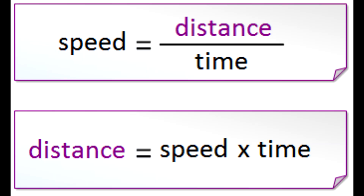Through this process, the sensor is able to find out the exact distance between the sensor and the solid object that the sound waves hit. This is because the sound waves travel at the same velocity through a specific medium. Before talking more about the Arduino board, the drivers, the motors and the circuits, let me just show you a demonstration of what actually happens.